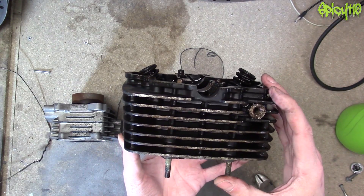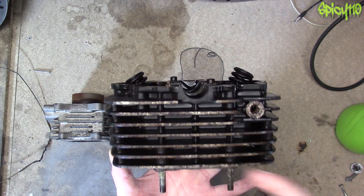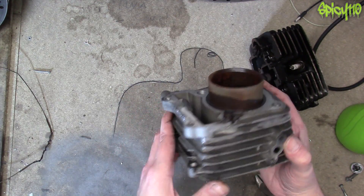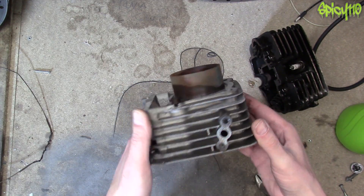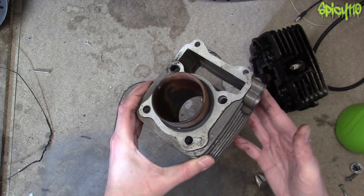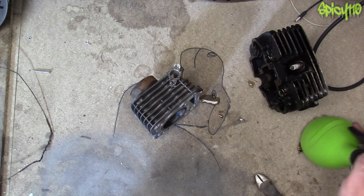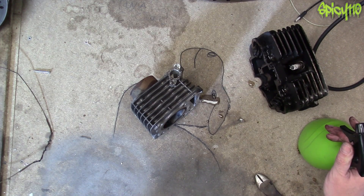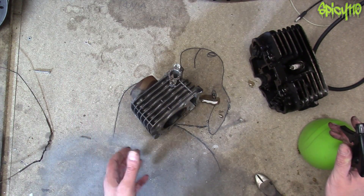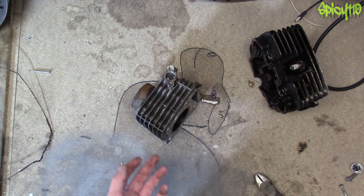The head — again, the edges are still sharp, you can tell that they're not warped in the slightest. If I just gave that a bit of a cleanup with a wire wheel — okay, forget the rust — you wouldn't know that I'd put that in a fire and then quenched it. So no, I think I can safely say now that spraying your engine with a water squirter is not going to crack it, unless it already had a crack from the casting.